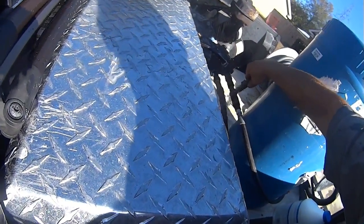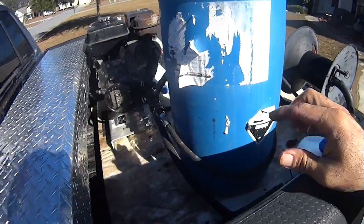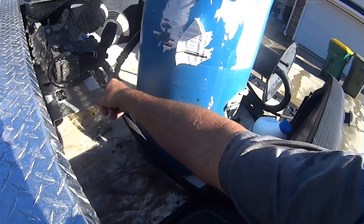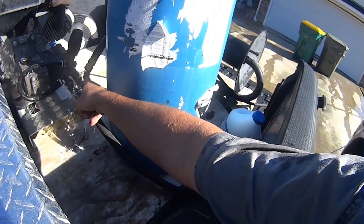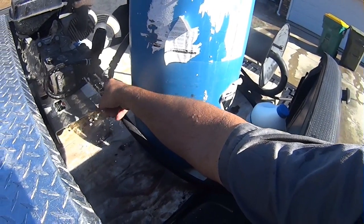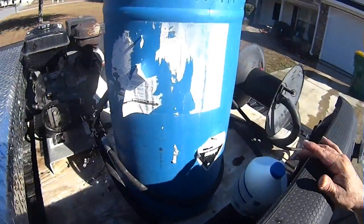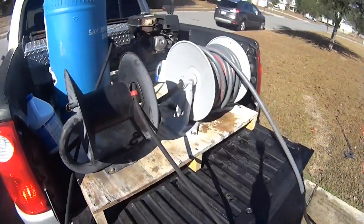Like that. I never shut it. I left it open because it's kind of rusted. So right now, clean water is diluting the sodium hypochlorite that's in here, and it's cleaning the injector ball and the spring. It's getting the corrosion. If you don't, it'll corrode, and then you've got big problems. So I let that run for a minute and clean that out.